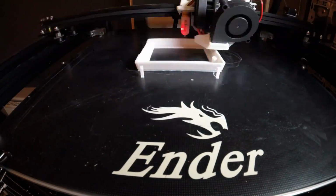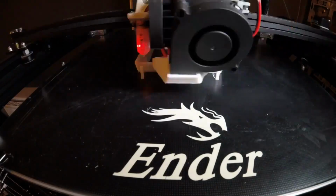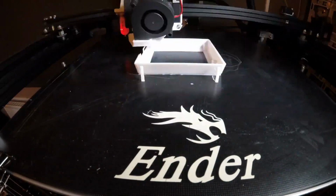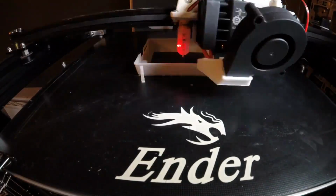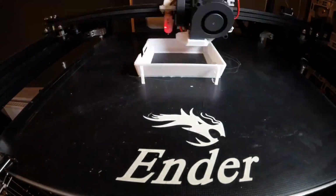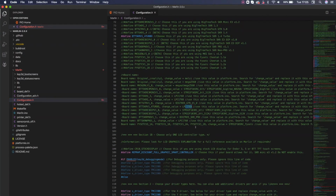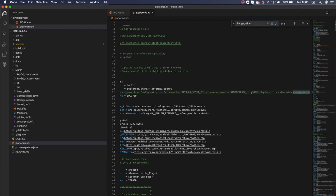So in closing, these are my final hints and tips. Number 1, ensure that your cable length is long enough to reach the hot end. In a standard configuration for a direct drive, it will not be long enough. Number 2, consider the mods that you want to undertake and carefully plan. For example, which fan print files will I use? Number 3, decide on the upgrade path stages. For example, do I just do the board, screen and drivers and do the hot end later?